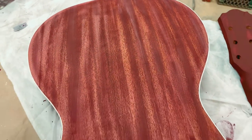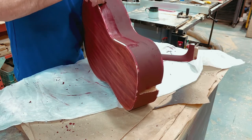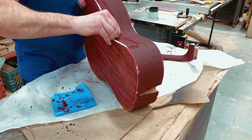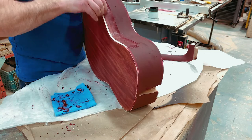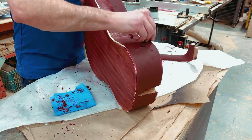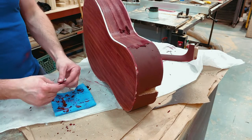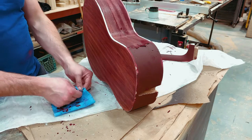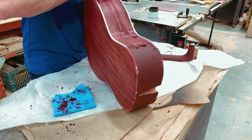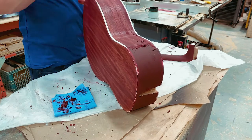I think this looks beautiful, especially compared to what we started with. I liked that original mahogany look, but I'm really fond of how this filler makes it look, how this filler darkens everything up, adds that red hue, and really just gives a really rich, deep look without even having applied finish. I mean, literally, this is just a grain filler at this point. So when you have a nice open grain, it has a pretty significant effect, and we can see that in some of the open kind of streakier areas because mahogany has this kind of streaky grain pattern, so you can see how that filled in those areas. And then where there's closed grain, it doesn't do quite as much, but it still kind of acts as a stain, this stuff, because it's an oil-based grain filler. Very happy with how this is turning out, as you can tell.